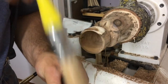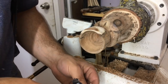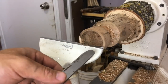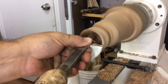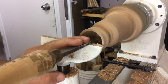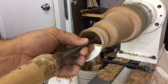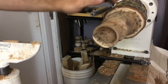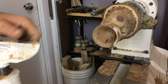Always take really good care of your Forstner bits and clean them off well before putting them away — the tannic acid, dust, and moisture they hold can make them rust and dull the edges prematurely. I'm going to finish up hollowing with a round nose scraper. I had to deal with a lot of vibration since this piece is hanging about 10 inches out of the chuck on a 2-inch tenon at low RPM due to the base being out of balance, so I took lots of really light cuts followed by shear scraping to clean up any tool marks. The inside of the cup is done with no torn grain.